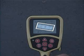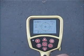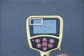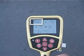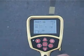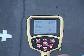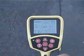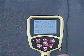After we get our first pole, we'll see a double line on the display. This line shows us how the transmitter is lying underground, and in most cases also represents the pipe's approximate direction. We know the second pole is on the far side of the transmitter, and we believe that the transmitter is to our left along this line. If we're right, the signal should increase as we move in that direction, which it does. The equator lies between the 2 poles, and we'll pass over it on our way to the second pole. We'll find the second pole and mark its position.